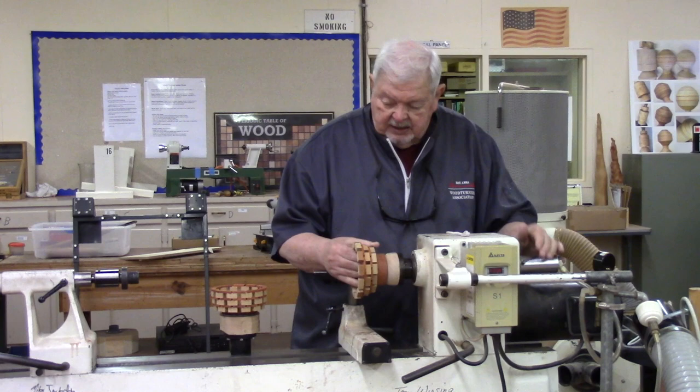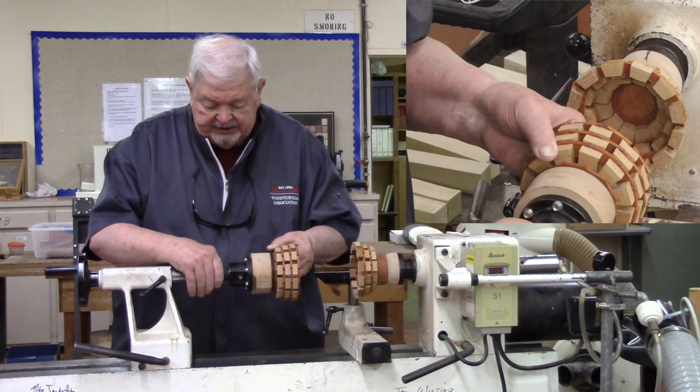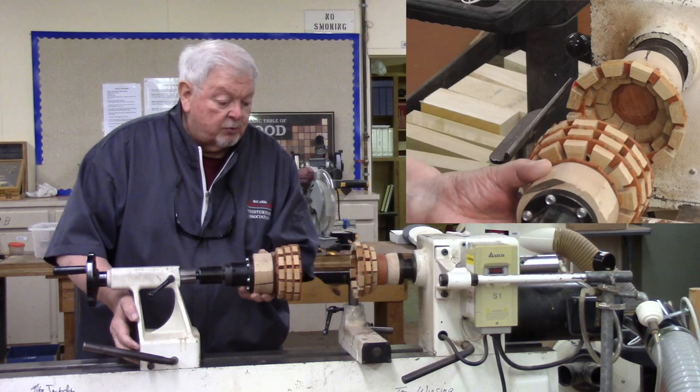And I'm going to put the top section on the tailstock. I'm using one of these Live Center systems that has a thread adapter that goes on, allowing me to screw my 1 1/4-8 faceplates directly on the tailstock. If you don't have something like that, a cone center set inside the face plate thread, I'll get it out, will work. Not so well, but it will work.